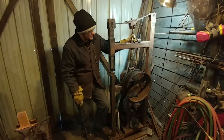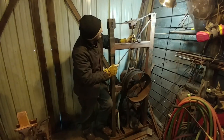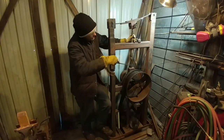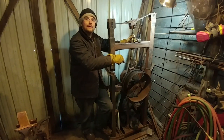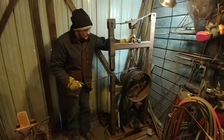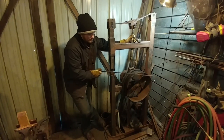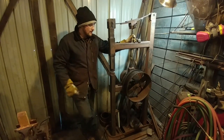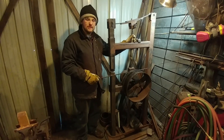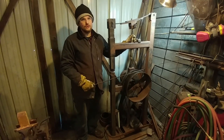The key differences: this is a compact design. The Appalachian power hammer has a spring that goes over it, rocks right about in the middle, and then has a toggle that goes down to a motor on the back side with your flywheel and things back there. Now where that has an advantage, with this design this piece here is a little bit in the way if you wanted to orient your dies and run a piece of stock in a certain direction. The way I've built the plans for this is for it to essentially be set up the same way.